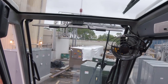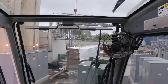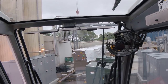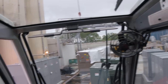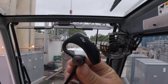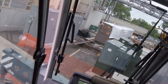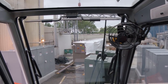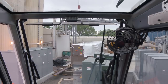Acceptable. It's my third in-line preferred method of crane signaling, because with cell phones there is just a little bit of a delay. So my first preferred method is hand signals because it's instant, and then radio communication, and then cell phones. But I've got my Bluetooth earbud, so I can operate hands-free, or I can operate and still use my phone for signaling without having to try to prop my phone up on my shoulder or put it on speakerphone. So yeah, that hands-free is a whole lot better deal.